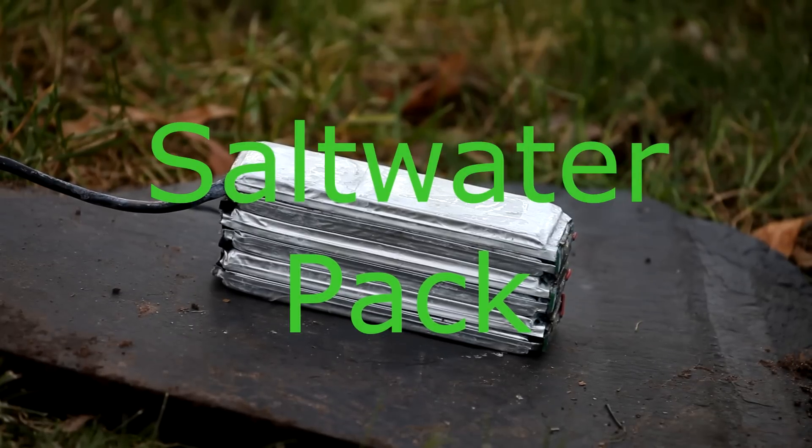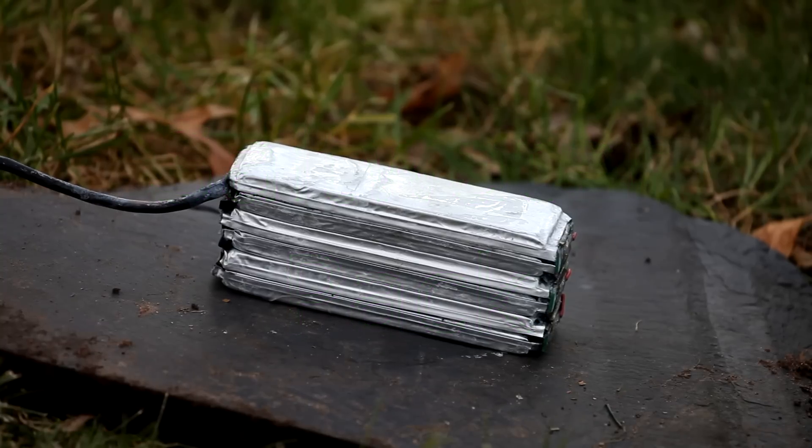So let's test out our method of safe LiPo disposal. There has been talk on the internet about saltwater baths for LiPo disposal or making it safe to throw in the trash. After resistively discharging a pack and giving it a saltwater bath, that may be okay. But this pack that was sitting in a brine solution for three days — after I cleaned some of the corrosion off the terminals — I have three to four volts across the entire pack. So to see if it is indeed considered safe for disposal, I'm going to drive a nail through all of the cells and see what the reactivity of the pack is.